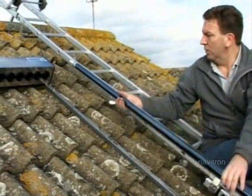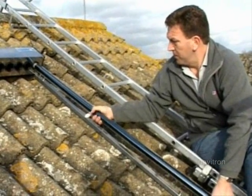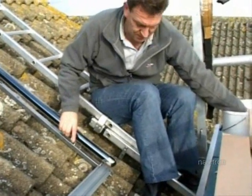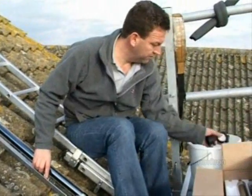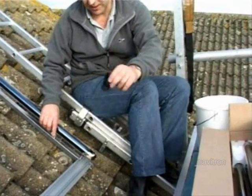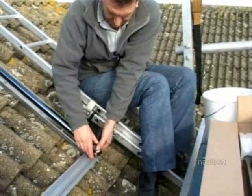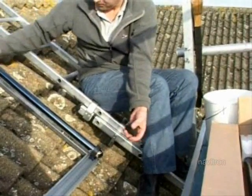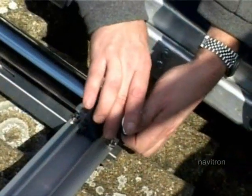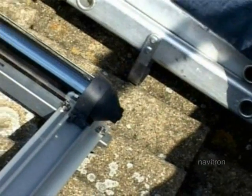Then all that you do is just put it into the tube there, push it home into the manifold. At the bottom end, take one of the cups — there's a grooved side, that needs to be at the front — so take the ring, put it into there, clip it down making sure it's vertical, and then just screw the end in. Just firmly, that will do. You still want to be able to move the tube a little, but obviously not slack.